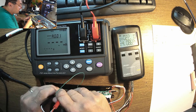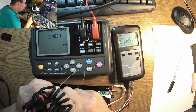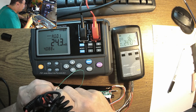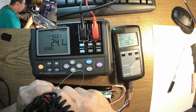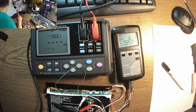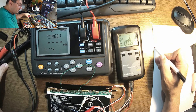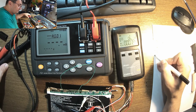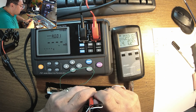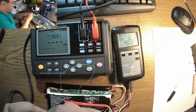The IOL1035 shows 22.1. Let me try again — I should push a little bit harder. Yes, it's the contact: 24.1. You really need to push to have good contact. Let's try the HiOki: 24.0. LiPo number two: HiOki gives 24.2, IOL1035 gives 24.0.